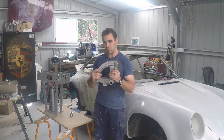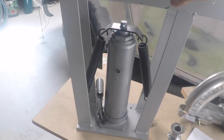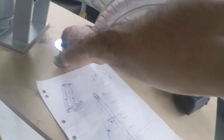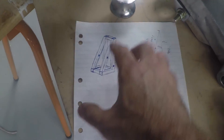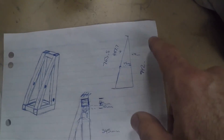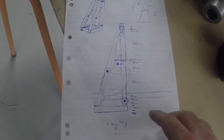So I now need to make the actual bender itself to house this die and get the job done. The first step was to go through a bunch of measuring. I'm going to use this bottle jack out of the original pipe bender. I've had to measure the height of the bottle jack, the diameters of the die, and how everything's laid out. I've drawn out a rough design and also done a quick 3D drawing so I know roughly where all the pieces of steel will go — and a bit of quick maths to work out the lengths of the sides of a triangle. If you can't remember your maths from school, don't look at me because it's probably wrong.